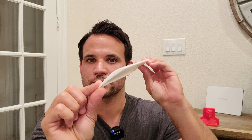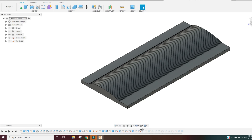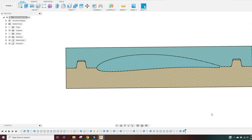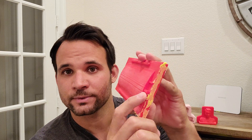Now let's talk about the two-part mold. The mold I'm making consists of two halves that fit together so I can make a bunch of airfoils. Start with the part you want and then build a rectangle or box below the center line or parting line. This bottom part will be used to pour the mold half for the top, and vice versa. When you create both mold negative halves you need to add features to make sure they align and stay that way throughout the pour — that's what these slotted features are. Add draft angles so it's easy to get them together and apart, and add a fill hole so you can actually pour into it.